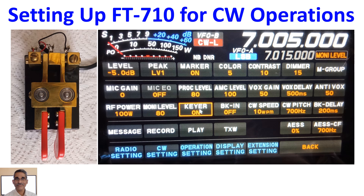I was a regular CW DX operator a few decades back out of sheer necessity. The 3x807 vacuum tube radio I had homebrewed then was CW AM and had no provision for SSB. With only a dipole antenna, I could not dream of working DX without CW. When I took my Grade 1 license and later Advanced Grade license, Morse code was mandatory for those grades, so I was having fair CW sending and receiving speeds.